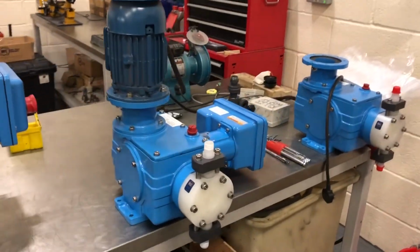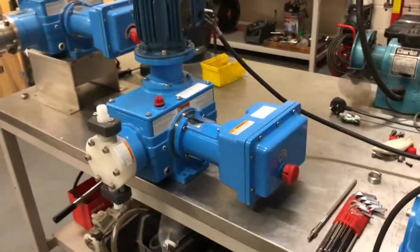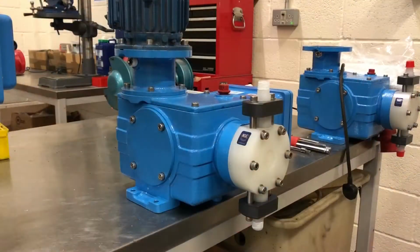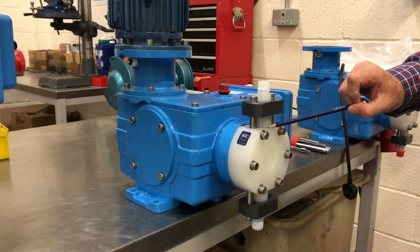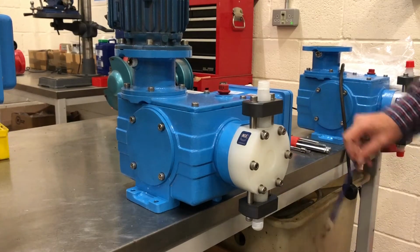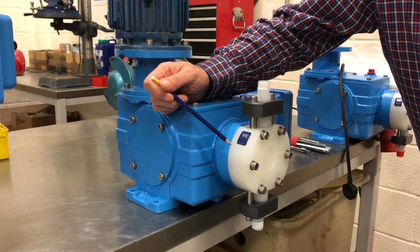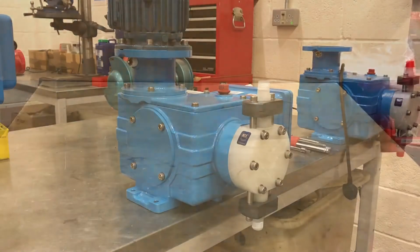Welcome to our video on how to refurbish the liquid end on an Encore 700 dosing pump. We're going to show you how to replace the discharge and suction valves, and in addition how to replace the Teflon faced diaphragm sandwiched between the head and the gearbox.